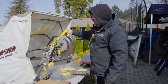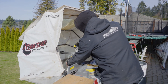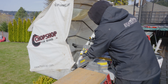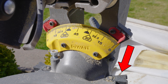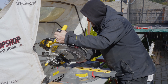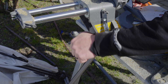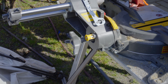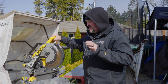There's a positive lock at zero for the bevel. If you want to turn it the other direction you just pull that pin and it'll turn to 45 degrees. There's also a way to go further than 45 degrees if you need to bevel past that — there's a positive stopper at 45 that you'd need to disengage. This back pin lets you swivel the saw right and left. If you need it back to zero you lock it in like this, drop it back to zero, and then you're back at 90 degrees. Just tighten up the back of the saw.